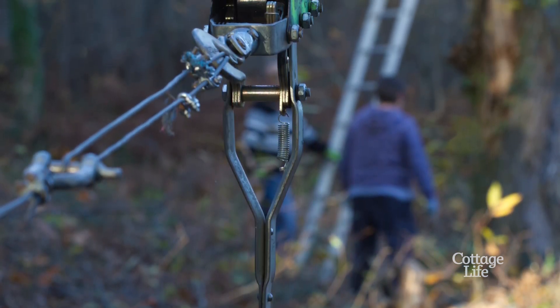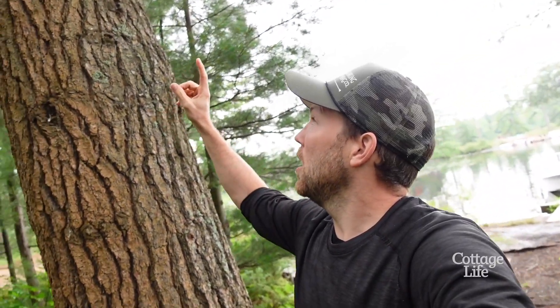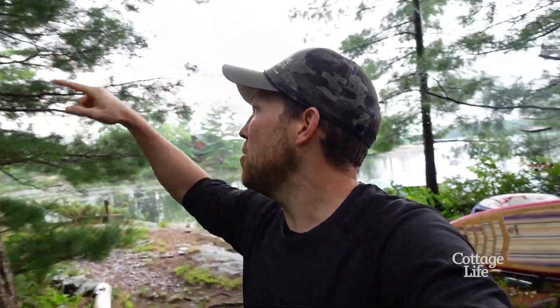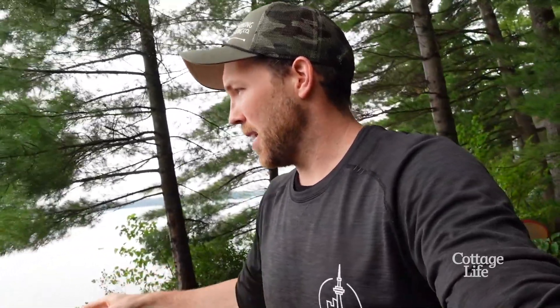In this case, I'd probably work with a roller to start, but I'd also work with a come-along. There's a big pine tree here that we can work with — we don't want to harm it, so we'd put some wood around the tree and use galvanized aircraft cable with thimbles and clips to hold it tight. Then we'd use a come-along on a big winch wire coming down and just winch the dock all the way back. That would definitely make things a lot easier.